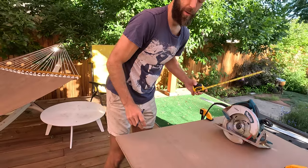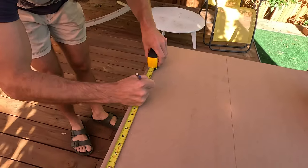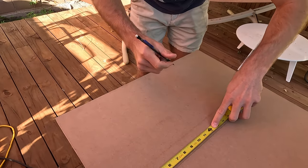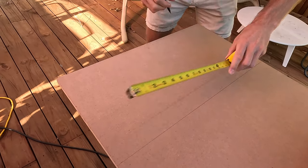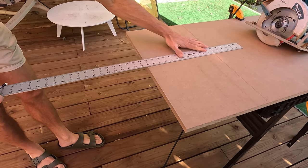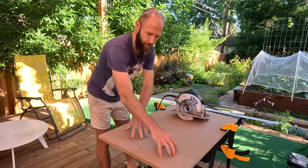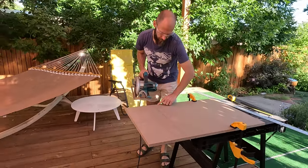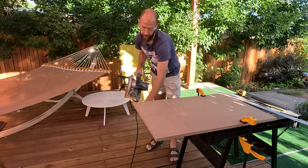12 by 12 inches, so you need two plates. I'm just going to measure directly in the middle here — 12 inches up there, 12 inches there — one more time with the straight edge. So now you have roughly two plates that are 12 inches by 12 inches. I'm going to take the circular saw — this will be a little loud — but I'm just going to run it right down here and cut this off. Watch your feet because this is just going to fall straight to the floor.